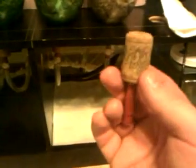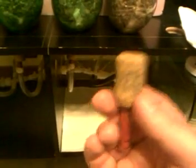The corks happen to be a perfect fit for the two-liter bottles and they are watertight — they do not leak at all. There is a little gap between the outside diameter of the cork and the inside diameter of the tubing, which I filled with Teflon thread tape just to close the gap. Then I zip-tied those as well, and fortunately those are also watertight.